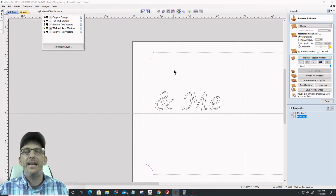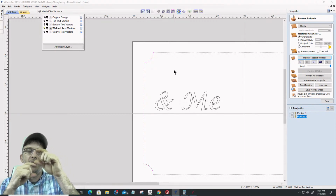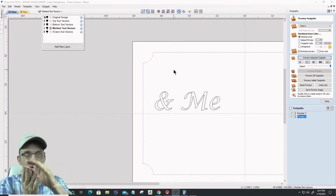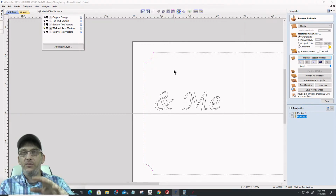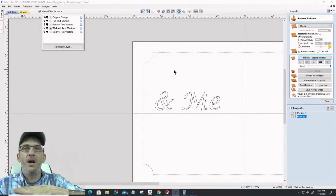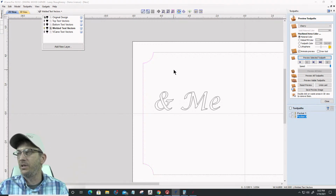Okay. And my letter heights and everything, I'm going to go with eighth inch and eighth inch, which is going to be a total pocket of 1/4. But my actual pocket is going to be 3/8 because remember, I already milled off 1/8 of an inch of that, right? Don't want to confuse you. We'll get into that in a minute when it comes to the toolpathing.